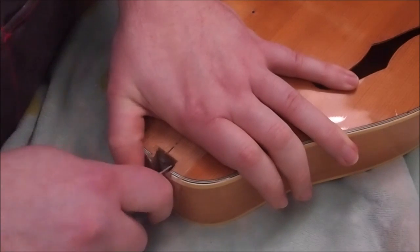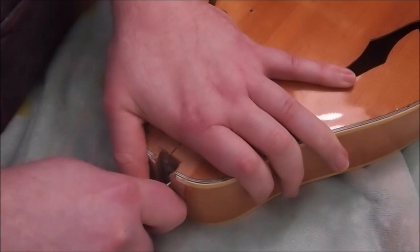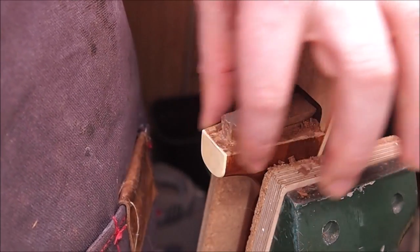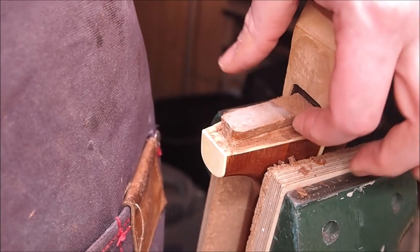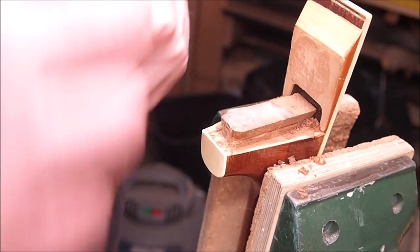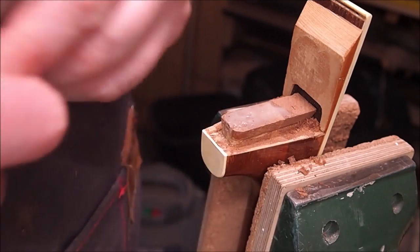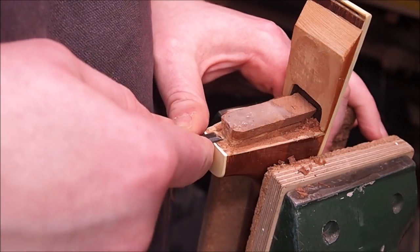Before I can start working on the angle I need to get rid of some of this glue so there's a place for the dovetail to move. I'm slightly dishing out the end surface of the heel — the end grain — leaving just the outside edges to contact with the body, maybe two millimeters on either side. This prevents all that material from getting hung up on the body and holding it away. It also makes the sandpaper pulling process a lot easier because I'm only going to be sanding on the edges and won't have to abrade the entire surface all the way to the tenon — that would take an awful lot of sanding. I'll also get in here with a small chisel just under the heel cap and bring that back too.